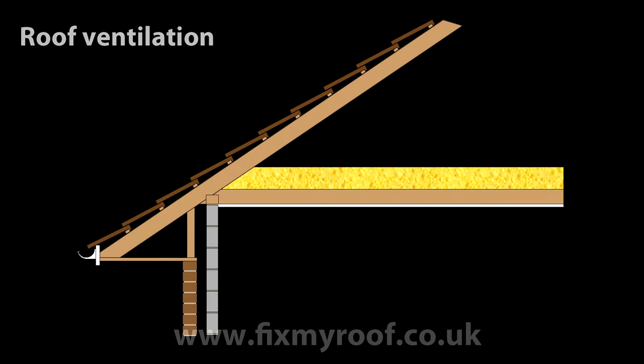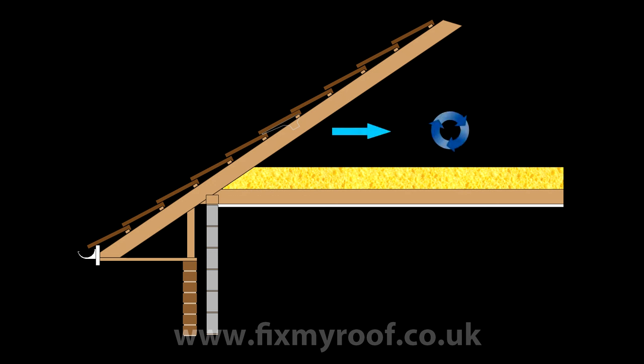In the case of standard roof ventilation, it's also common to install in the bottom third of the roof, just above the insulation again. One of the reasons for this is because fresh air circulating above the insulation is very good at drawing out any moisture trapped in the insulation below without cooling it too much and robbing valuable trapped heat at the same time.